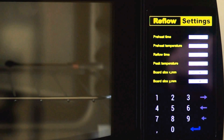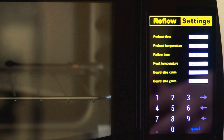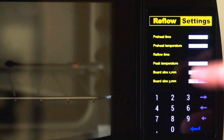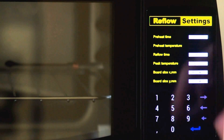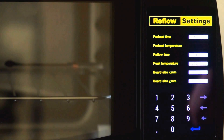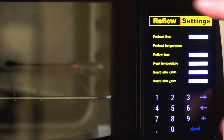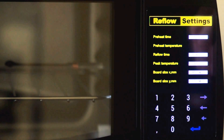This user interface is very efficient. I have a large array of variables and I track everything I'm painting on screen. So when I want to change something like a box, I don't repaint the whole screen — I only repaint that small portion. The clock speed of the processor is only around 200 MHz and the screen is extremely large at 480 by 800, so it's basically near the limit of the processor.